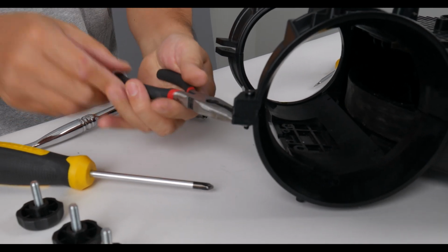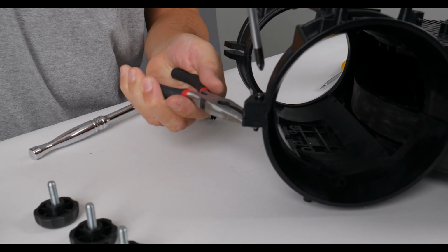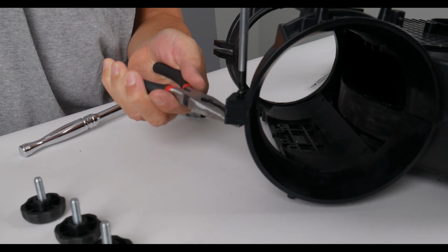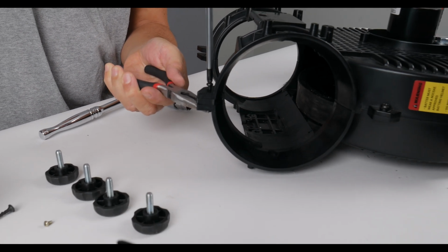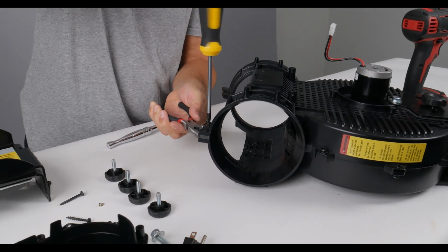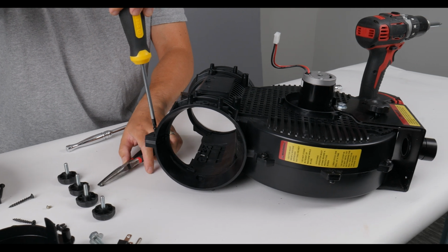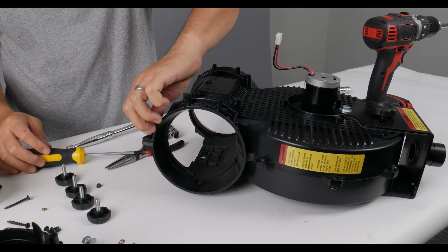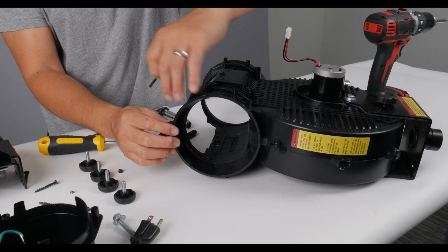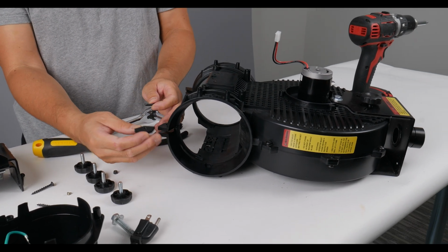There is a small screw at the front of the pitching machine. You'll need your pliers to secure the nut and use a Phillips head screwdriver to remove that screw. As the screw lifts away, there's a middle piece that sits between the 2 pieces of housing that you'll have to keep your hands on, so not to lose it.